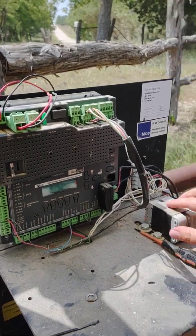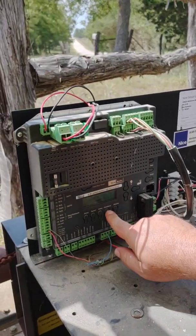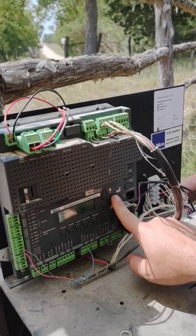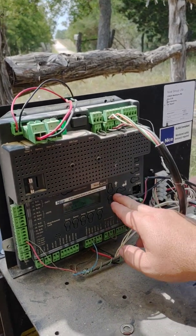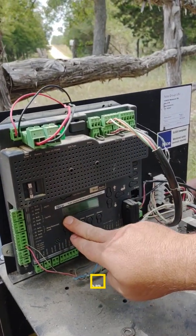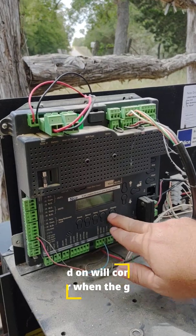They bypassed the safety equipment out here — no comment. Gate close functions. This one's been out here for a while. Go down to your charger and see it's on. You want to answer okay to all the following questions. Depending on the firmware version, it may ask you up to five different questions. Then you want to go and turn your standby on — this one's already on for 20 seconds. Now you're going to regulate the solar panel to maintain the battery. Just make sure your standby and your charger are turned on on your board.